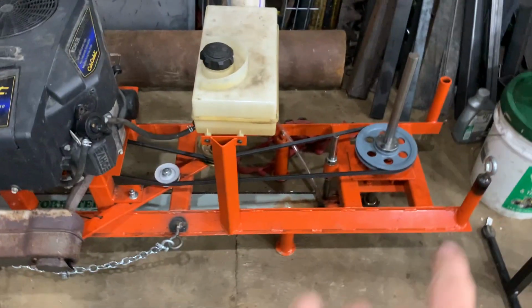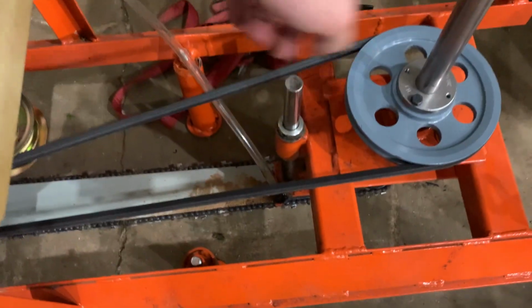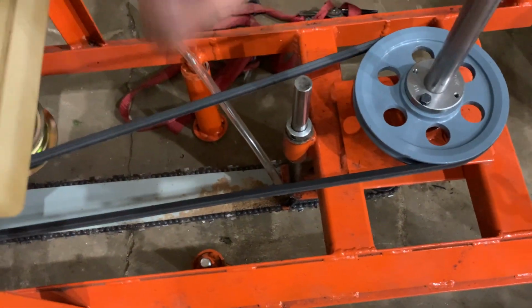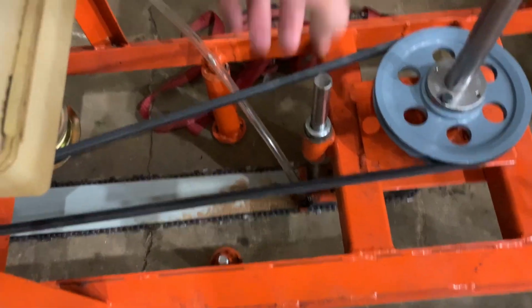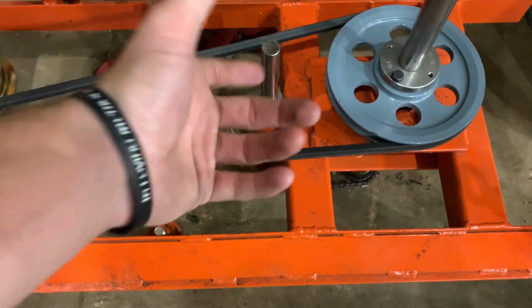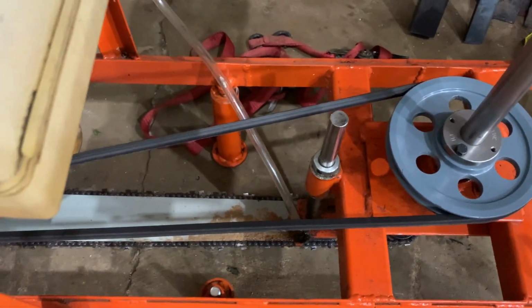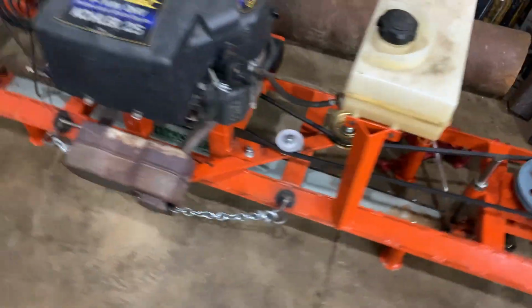So I would change those to a bigger shaft, and then I would machine a crank mechanism so I could crank these up and down with a piece of Acme thread or something attached to the top. Setting the depth of cut is kind of a pain with those shaft collars, so that's another thing I would change.